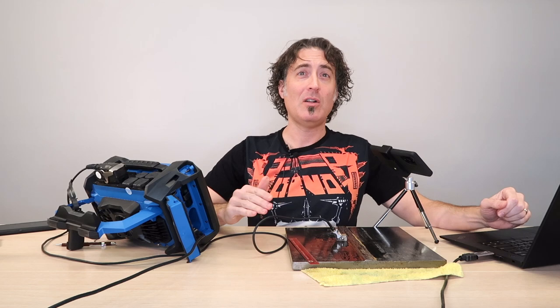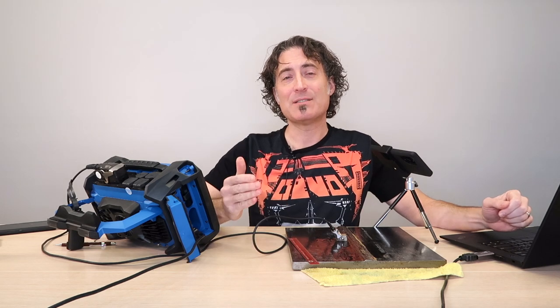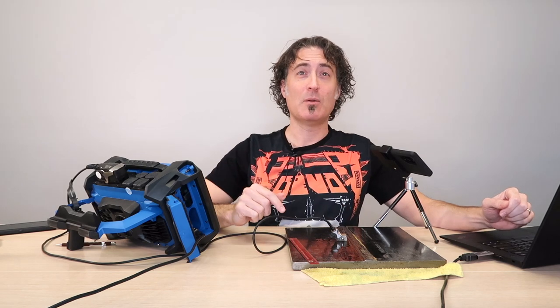The second peak in the twin peaks is the far side root signal, and that's normal. It can be there all day, every day. It's going to be a little bit irregular as you move the probe down the length of the weld — that's fine because the weld root is probably irregular — but if it gets out of hand, if it gets really obnoxious, it may be a sign that there's a problem on the far side of the root.